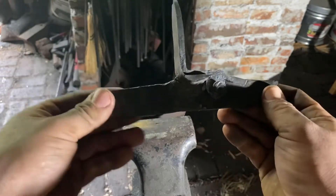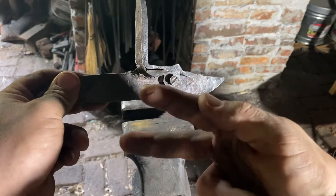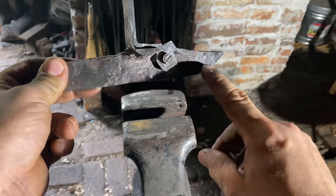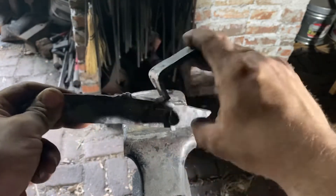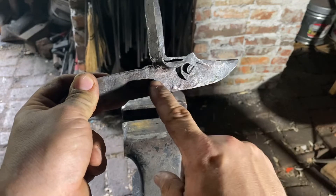For the spring, I'm thinking I can make a V-shaped spring with a short leg on top that'll ride on the nub here. I'll file this flat so it anchors here — the little nub rests on this, which provides the tension for the pan. And then the long leg will come back to the hammer.